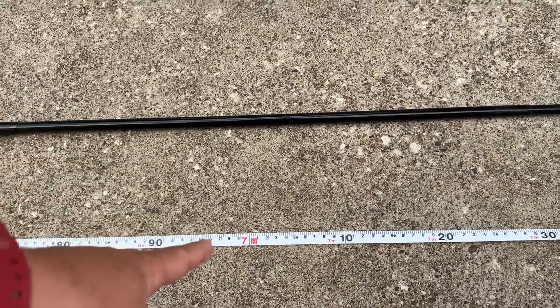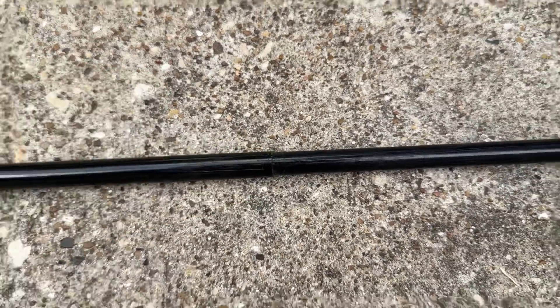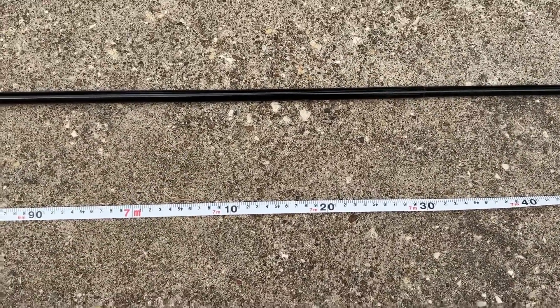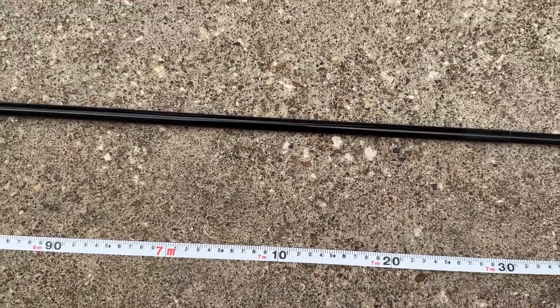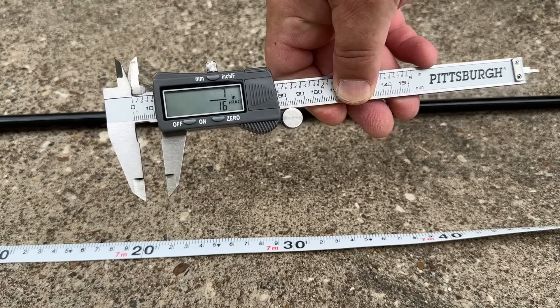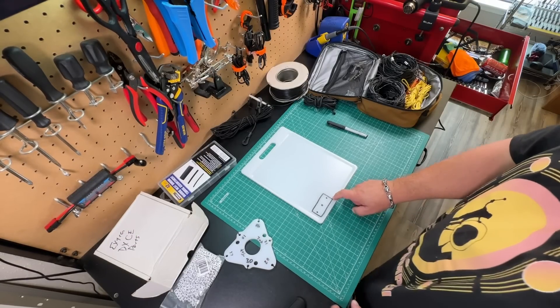Here is seven meters on the mast, and I only need to go up about a foot. I'm going to make the spreader hole so it stops right on this section. I'll need maybe eight or nine inches of doingy cord, and it'll stretch because the radiating element should be just a touch over seven meters. We've got about a seven-sixteenths hole that I need to drill in that plastic. Now we can cut this out, drill it, and see how it fits.